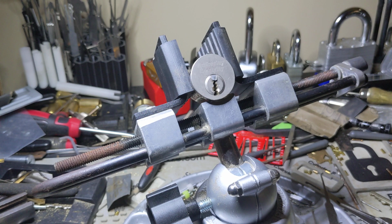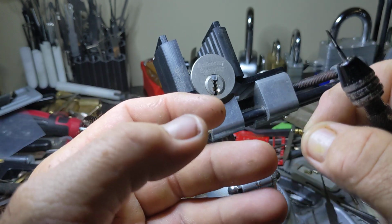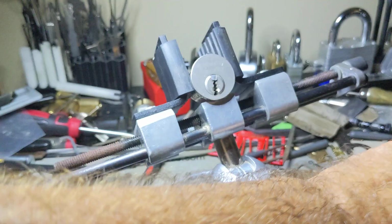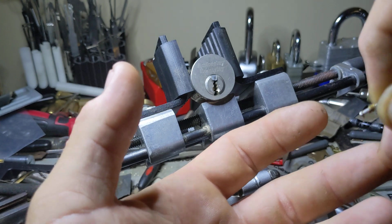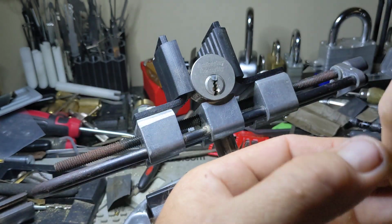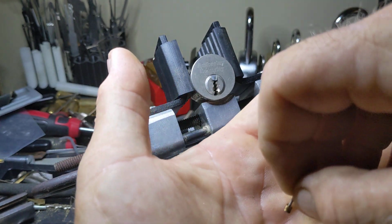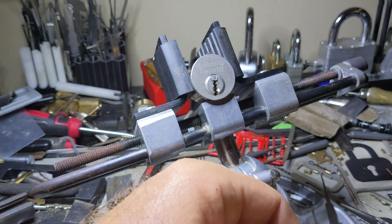And then at that point, you'll clip that into your Dremel, or well, the Dremel's my main lathe. I don't really use many lathes, even though I got a couple of them here. One's been partially used once, the other one's still brand new in the box. But I got a little over-the-counter pill bottle I've cut the top off of about halfway down, filled up with rubbing alcohol, and so just let it spin in the rubbing alcohol, work it back and forth, and take a toothbrush and clean off all the excess flux.